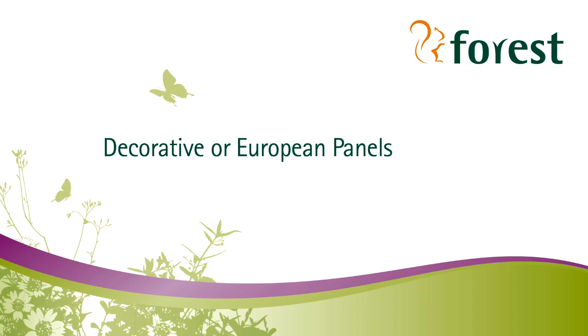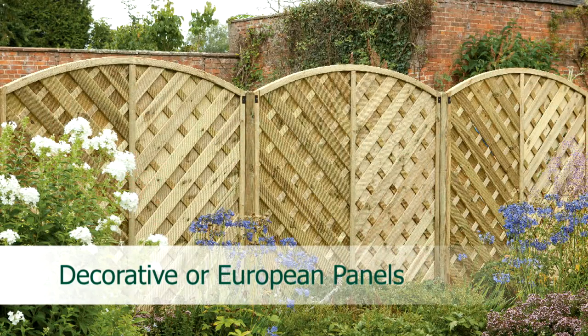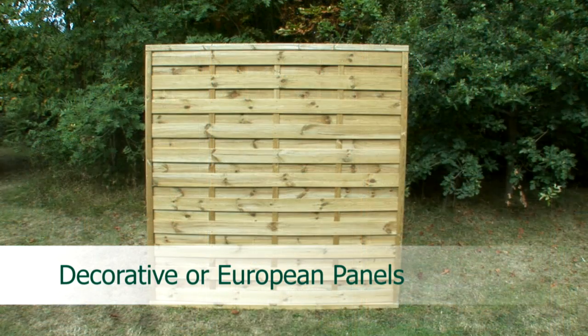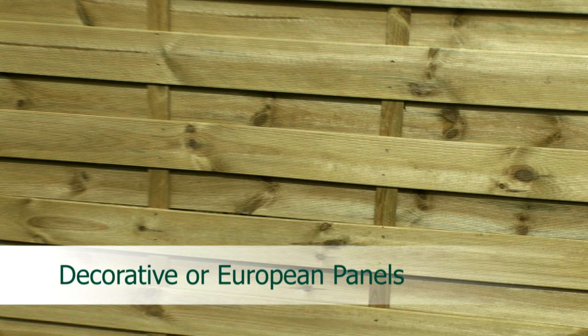In recent years we have taken the lead from our colleagues on the continent and started using a lot more decorative panels and screens in the UK. All the panels in this range are pressure treated and can be installed without gravel boards. They also don't need to be regularly treated with wood preservative. These panels come in a variety of designs and sizes and offer the ultimate combination of design and strength. Decorative panels are constructed with planed pressure treated timber which is smooth to the touch. The size of boards used in their construction is generally a hundred by eight millimetre with a decorative ridged finish. Each individual board is fixed on either side or offset to the 45 millimetre vertical battens running through the centre of the panel.